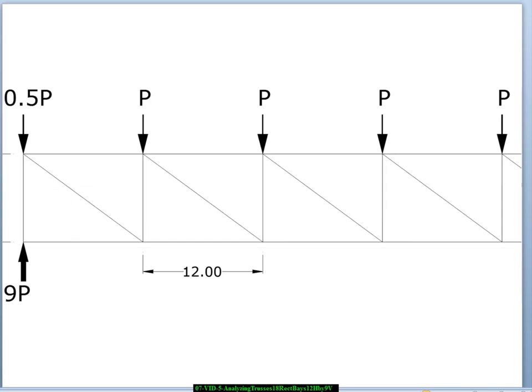If we zoom in on the truss, it looks like this: 9 feet vertical, 12 feet horizontal. The slope will be 4 to 3, and that will set the proportions not only of the web members, but also the proportions of the coordinates of the components of the forces along these diagonals.